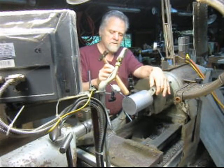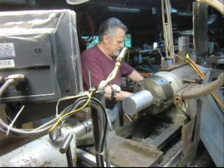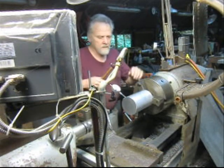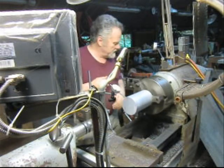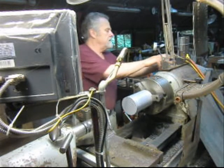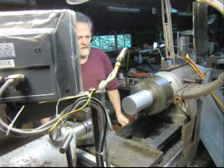We've got about three or four thousandths of play in there — I think that's plenty. Let's snug this down. Make a quick spin one more time. Looks like that brought it down even more, so we've got two or three thousandths. That's plenty. Get rid of the indicator and let's start it up and see what it looks like. Looks pretty good.